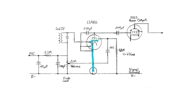And it connects to, which is important, our signal ground in this case. Now this is not chassis ground, this is signal ground. And I spent some time talking about the difference between these two in the series on repairing and restoring this radio. So check back with that. But signal ground is not the same as chassis ground. Signal ground is the ground that's relative to all the signals that go on in here, is not ground relative to earth ground or to the chassis ground.